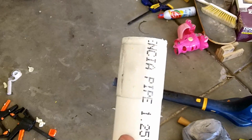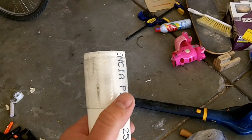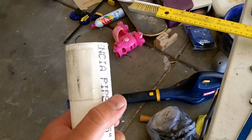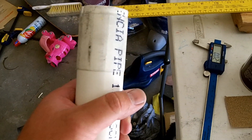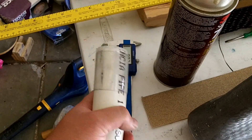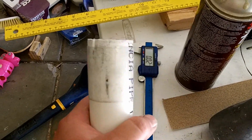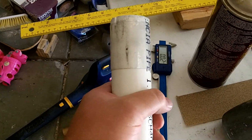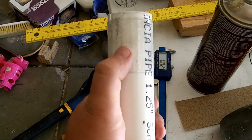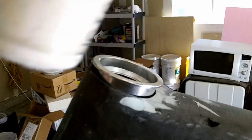The way that I'm doing that is I took this piece of PVC pipe, I wrapped it with some clear packaging tape to get the correct width, which I need is 44 millimeter. I took my calipers and measured the thickness of the sandpaper, then I'll use some Super 77 spray on here and glue the sandpaper onto this pipe.